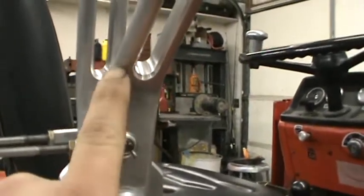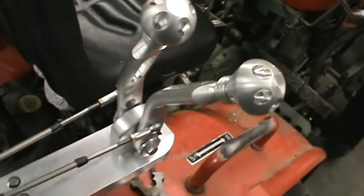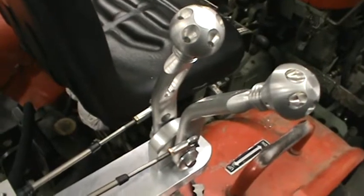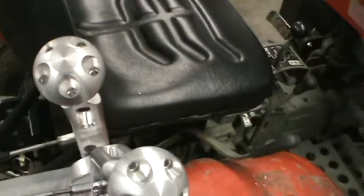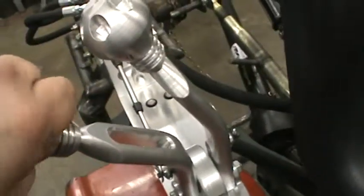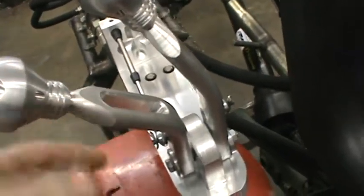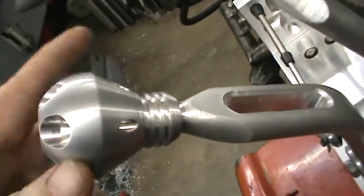These handles were just some raw stock aluminum that a friend had. He works at a company that makes stove parts for refrigerators and stoves, and these are actually aluminum handles off a side-by-side refrigerator. They had some that were bent or whatnot, so instead of throwing them in a dumpster he brought them to me. I turned them down, threaded it, stuck it in a lathe, threaded it back, just goofed off more or less. Cut the center out.